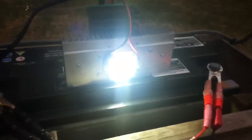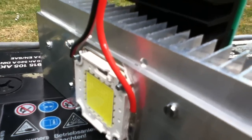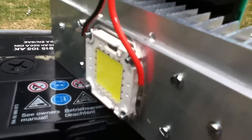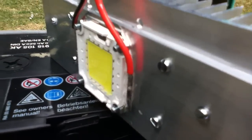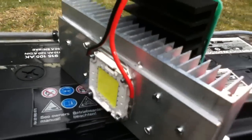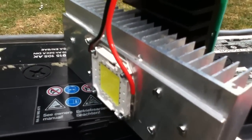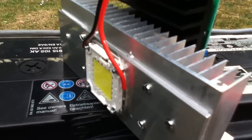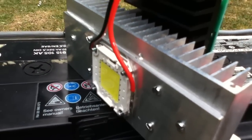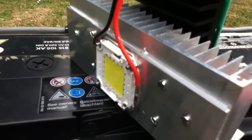It doesn't look like much during the day but at night it's pretty bright. I've applied lots of heat sink thermal grease between the LED and the metal plate it's mounted on, and then again between the metal plate and the aluminium heat sink. You don't want areas where metal is not in contact with metal — you want the grease to fill in all those gaps. The grease isn't as thermally transmissive as the metal, but it's better than an air pocket, so you need to heavily grease it up. It still does get very very hot.